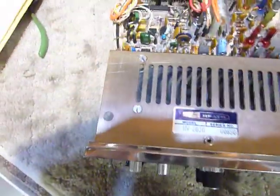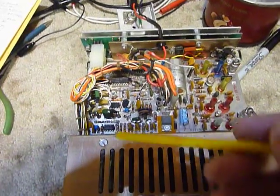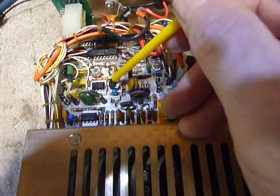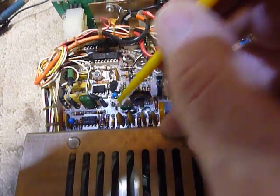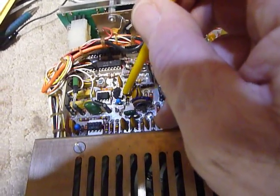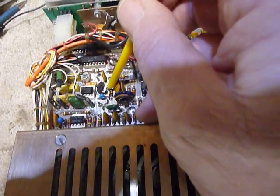The PL generators in these are not the best, but if you're using one at your QTH you can use them. Right here you see that little black trim pot — I have a 25,000-ohm trim pot with a 4,700-ohm resistor in series connecting to ground, soldered right to the circuit board there. The other end has a little wire looped around the end of that 100,000-ohm resistor right there — that was really difficult to solder because it's so close to the circuit board, but it works fine. Be sure to check with your meter that you don't short out to the board.